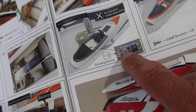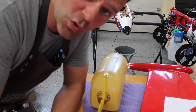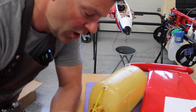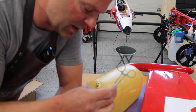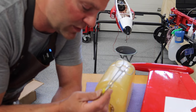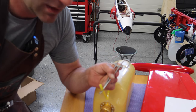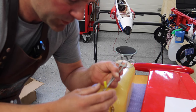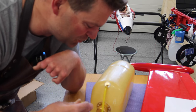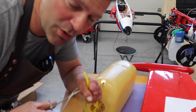Tip time for this episode: I'm going to show you how to leak test a tank. All we do is take a piece of Tygon tubing, put it over top of the vent fitting - Tygon's nice because it's easy to work with. I've put a piece of forceps or clamps on this piece of tubing. You can also heat it up and squish it with your pliers, which works very well. That side's clamped off. Then take the other side - do NOT use your air compressor, way too much force, you're going to blow your tank up. All you're going to do is blow into it with as much force as you can with your lungs, then clamp it off.